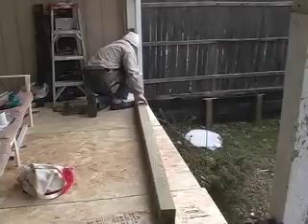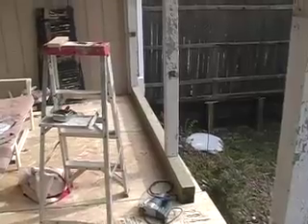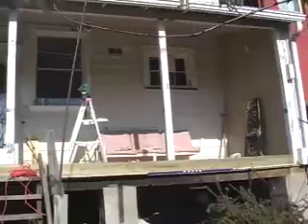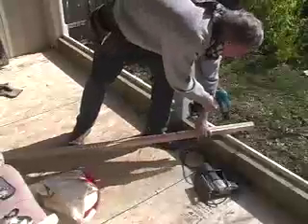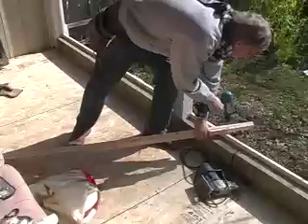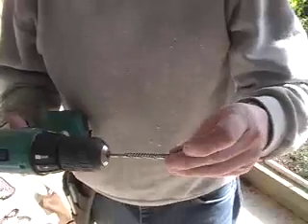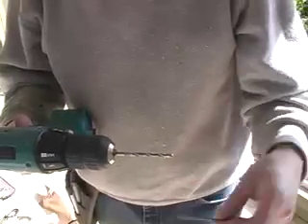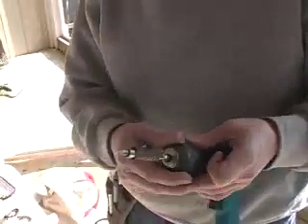I don't want a knee wall — that's a wall that comes up two or three feet — because I want all the sun I can get to come in and hit that floor and wall so I can heat up the porch. There's the post repositioned for a door and two pieces of glass. Then I put this trim around — that trim is there to accept the glass and I put that on with drywall screws. If you're a professional you might have a nail gun, but don't go out and spend all the money on that if you're going to do it yourself.